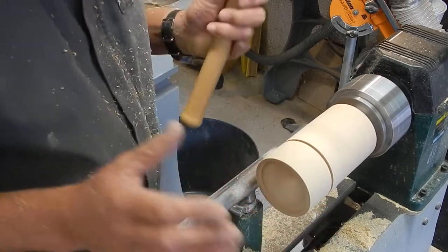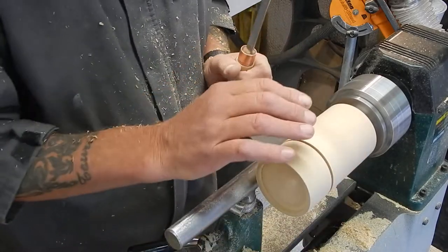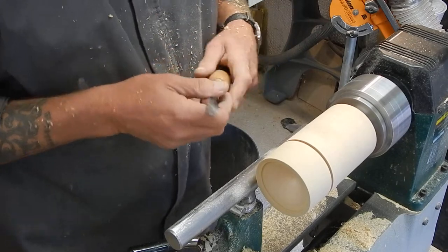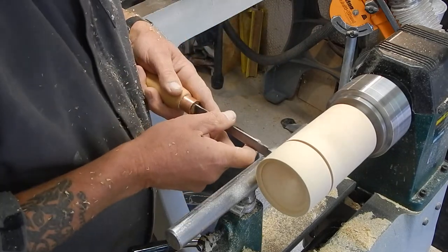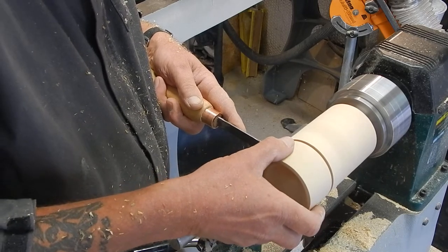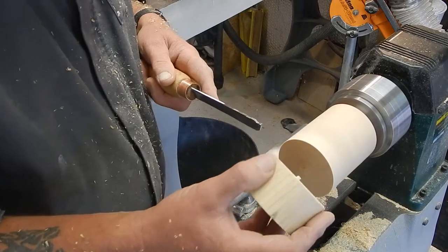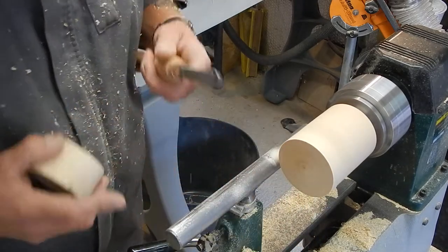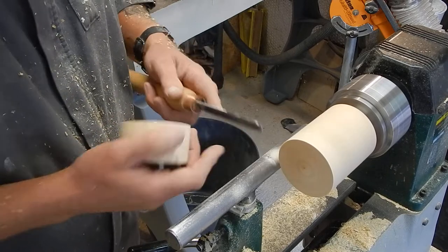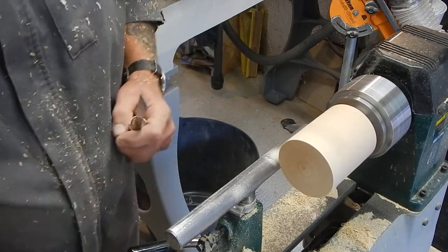Keep going, very gently. Now, for me to turn in, I would say stop there. Beginners, stop your lathe, get your handsaw, and cut through. But for me, I find it quite safe to go through, and there you go, it's off. Now you can't do that with normal parting tools. It will bind up on you, it'll smoke, and it'll become very hard to do. You can do it with this tool.